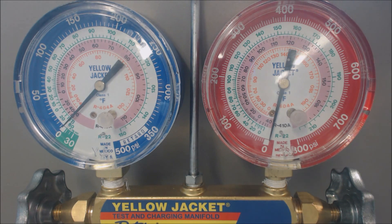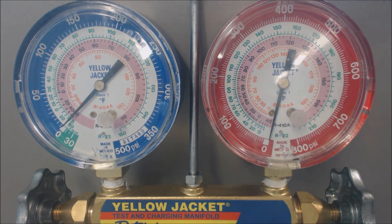That could be due to a few different things. We know that this side has to do with the outdoor unit — it has to do with the condenser coil. This has to do with the vapor side. Our liquid side has to do with the condenser as far as this gauge set, and how we're reading sub-cooling and superheat for the evaporator coil.